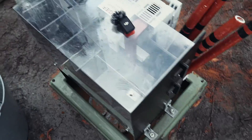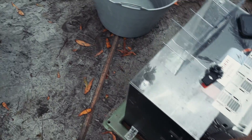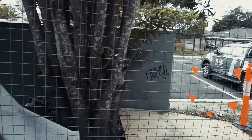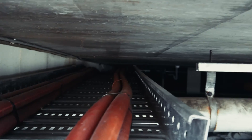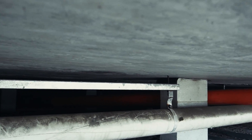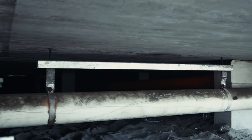New mains running through into our load side. So far we've got conduits ready to go into this pad sub. We've got a 30 metre run of cable tray heading under the floor, off into the next room, under that next section of the floor and into the bottom of the board.